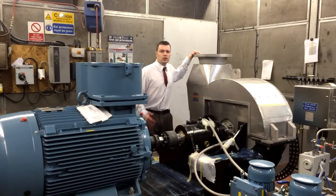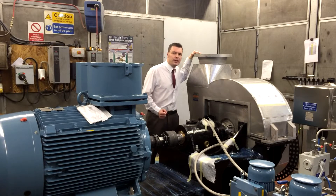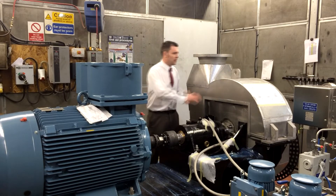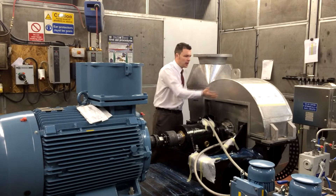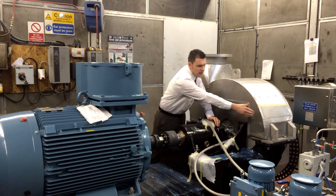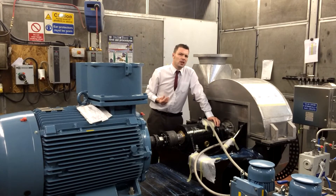We're joining now in the Halifax fan test area. This is the fan in question — it's a size 30 Mercury backward inclined. We've got a 304 stainless steel fan case that's clad with acoustic and thermal insulation. You can see on the end here, just sticking out of the insulation, 50mm thick side walls and the casing.